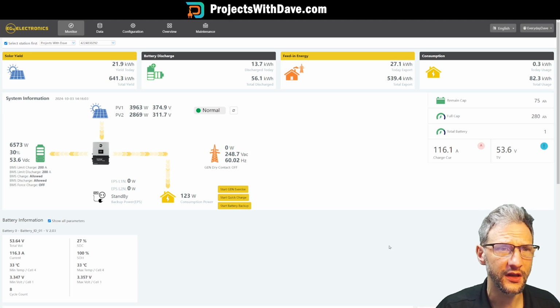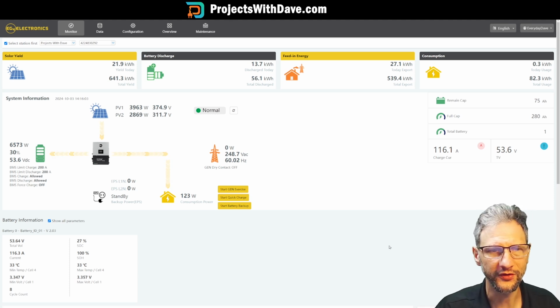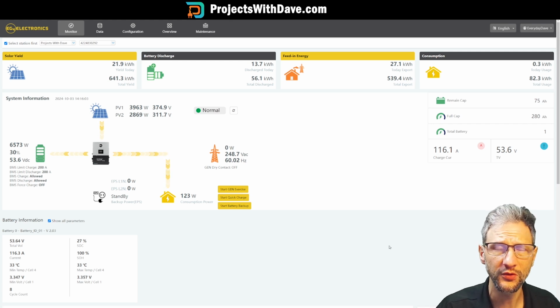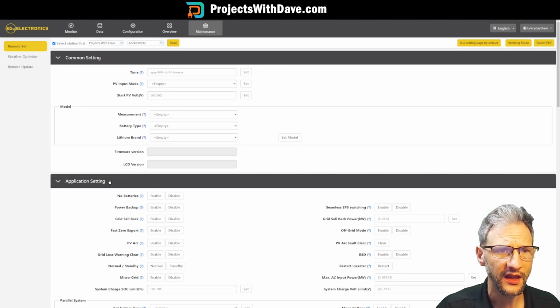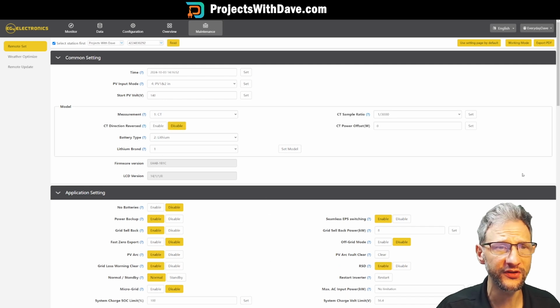All right, I'm going to go over some settings with you here. I'll go over the ones I currently have mine set for, but as I go through it, I'll explain some of them, and hopefully that will help you choose your settings or understand what kind of settings can be selected for this inverter. So here we're on the main page on our monitor, and to change the settings, you'll click here on Maintenance. And then at first it looks blank. You'll need to hit the Read button, and that brings up all of the settings as it reads them from the inverter. I'm not going to go through every setting, but just some of the key ones that we need to have for the inverter to operate the way I have it currently operating.